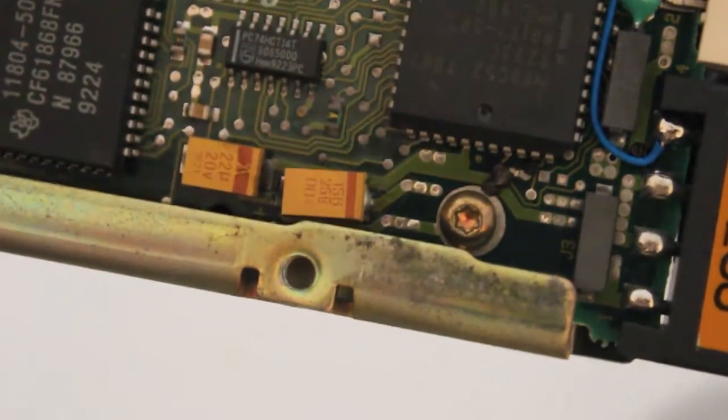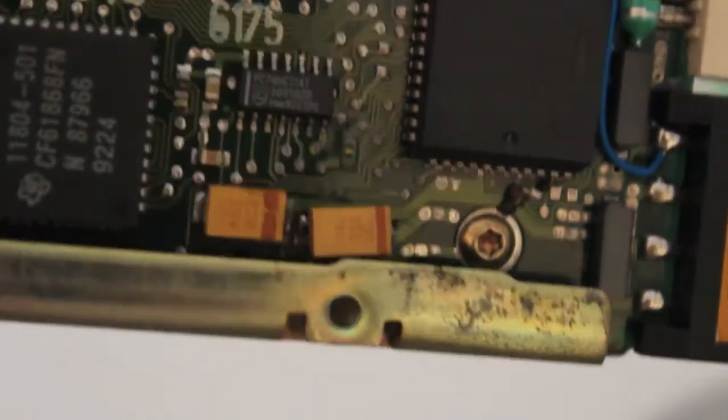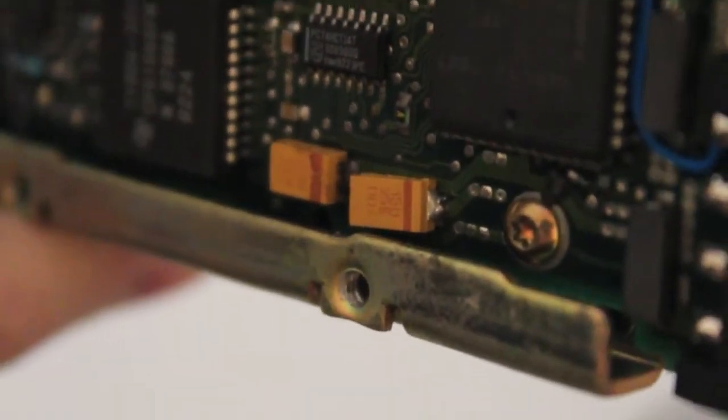There's not much clearance on one of the sides there. There's another capacitor in the way, but let's see what we can get to happen. And that is completely out of focus, apologies. But there we go. Not too bad of a job. Just make sure that your solder is definitely connected on both sides, which mine is. And then you can move on to testing.